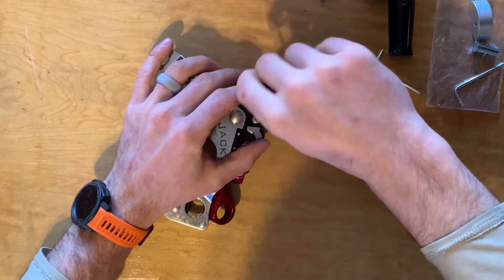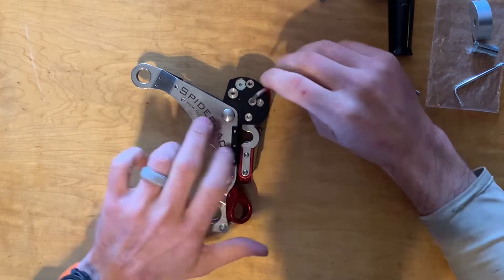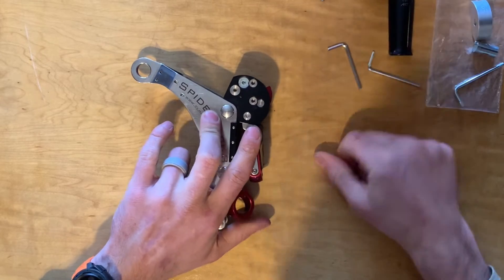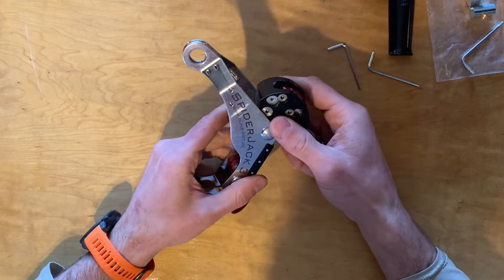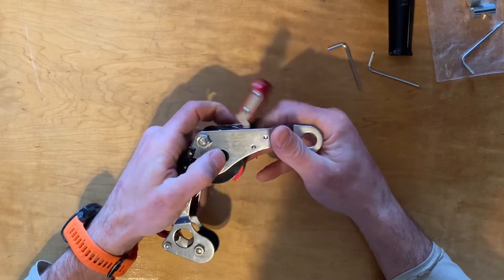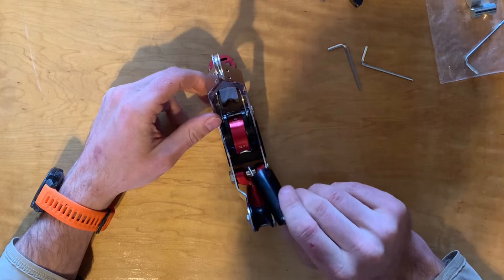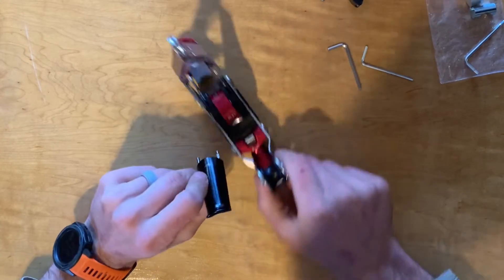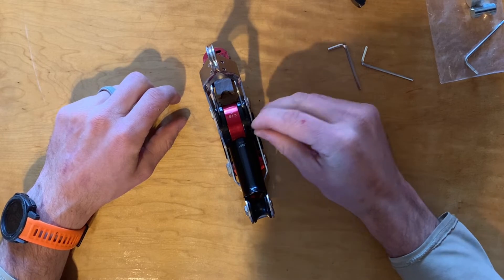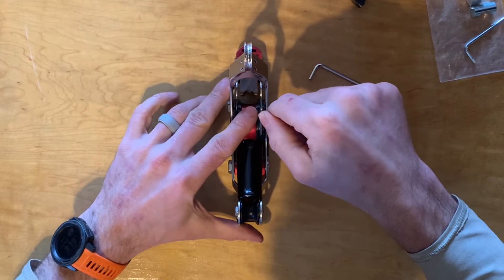You want to be careful not to over-tighten this — it has a little rubber O-ring on it. It's not going to back out on its own anyway, plus it's trapped behind this sheave. Just don't over-tighten it; once it stops, I'm good. We're going to reset this assembly back into the sheave by pushing back down on the locking mechanism. Then put this handle back in — the pins of the handle go in facing this way — and put this little set screw in there. Again with the smaller allen wrench, just until we hit a dead stop. That's swapping out a friction clutch on the Spider Jack.